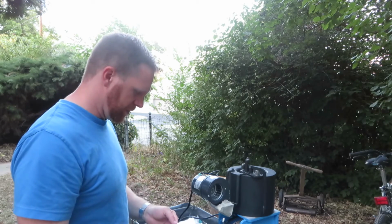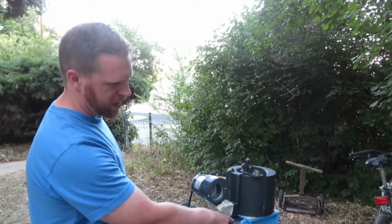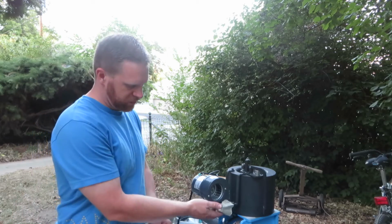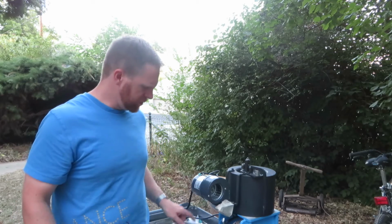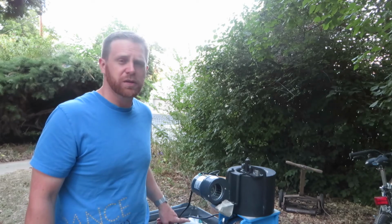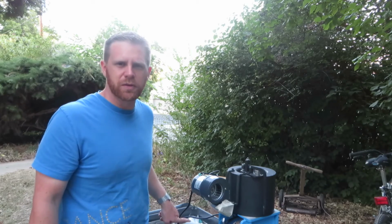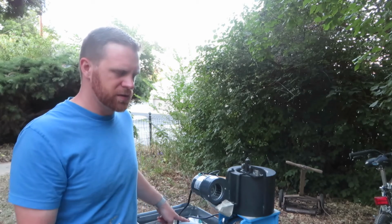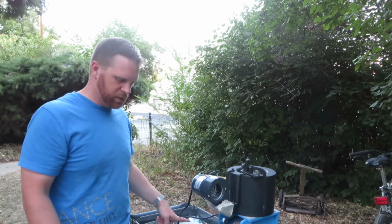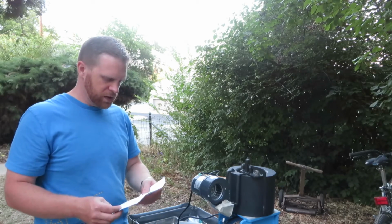The fan duct is pointed to blow air straight down instead of at the top of the sprue where the air is actually needed, which is why I've cobbled this together. The PID temperature controller is limited to 850, which is plenty for casting lead. If you're wanting to cast other metals that might be usable for bullets or jewelry or other things, that may be an issue for you. I do like that you can set it at an exact number and leave it there.